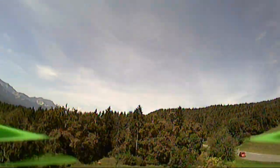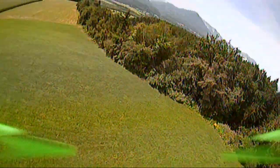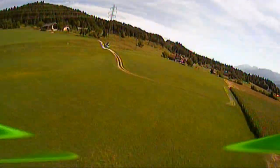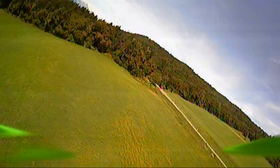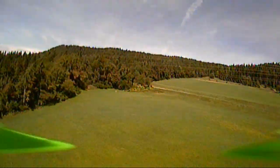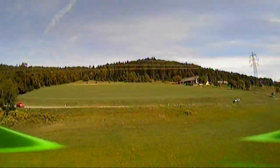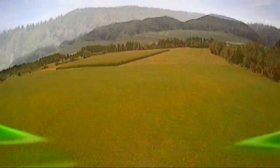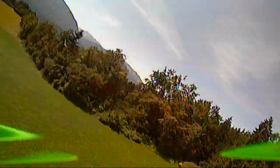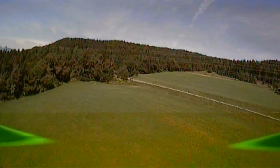Much better in rate mode — flying it is fun and awesome. It really reminds me of one of my very first mini quad frames, which was the FPV250 by Hobby King. It was a plastic X-frame and really fun to fly, and this one is similar — I love it. One thing I do notice is that there is some jello in the recording. I did not see this when flying, but it is visible in the recording. I am not sure if this is because of the camera, an unbalanced prop, an unbalanced motor, or just because the frame is not as stiff as carbon fiber. I will have to further investigate this.